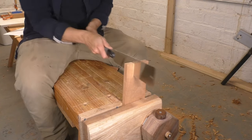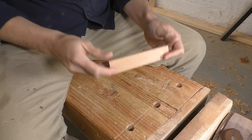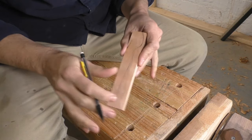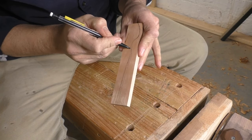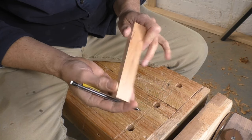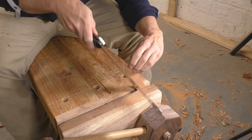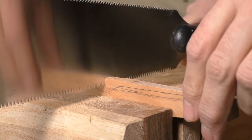While the glue is drying, you can make your wedge. I'm cutting mine from a cherry board. For the curves on top, you can draw them freehand — I have clear drawings in the plans. The wedge itself needs an eight degree angle. I find it's helpful to make your wedge thicker and longer than you think you need, so that even if you have to do a lot of planing and trimming to get a good fit, you still have enough material when it's all over. Cutting the details for your wedge is easy — saw the straight lines and chisel the curves, or saw them out with a coping saw.